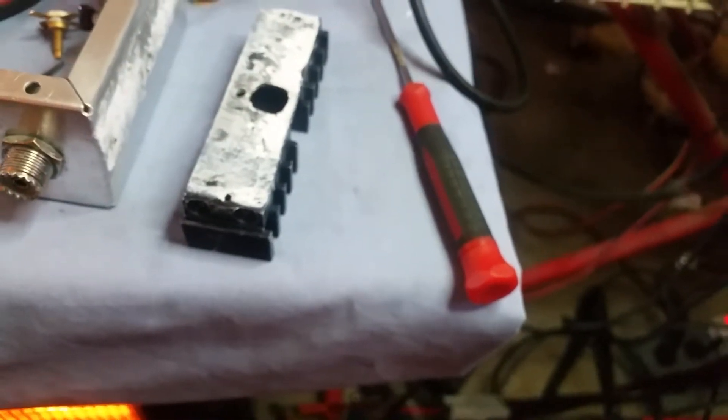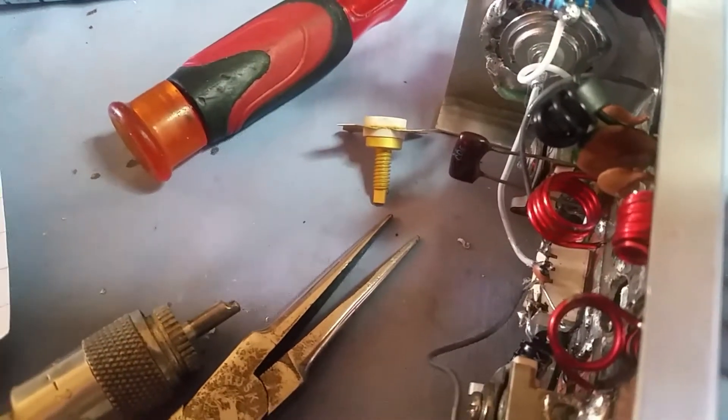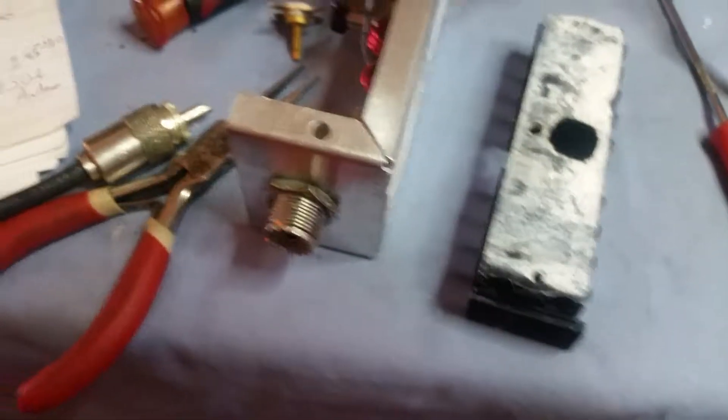I've spent two days on this thing on and off - there were things I had to get done like shipping and stuff. But it's time for this to come to an end. I'm hoping I put this transistor in and it's going to be all good. This transistor I've already tested - it's got an HFE value of 68 on the Atlas tester. Brand new old stock. I like to keep some of these transistors around just for issues like this. I've got maybe 12 to 15 studs and a couple of 454 studs for older projects using stud mount.